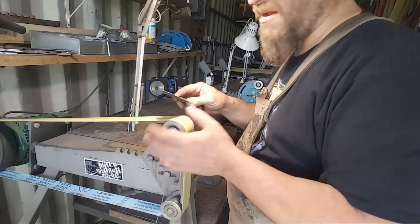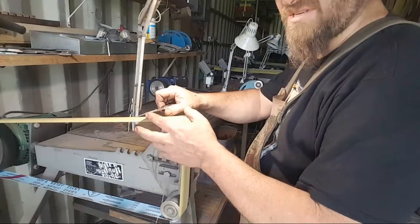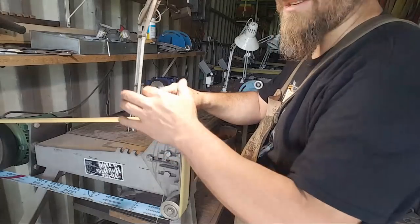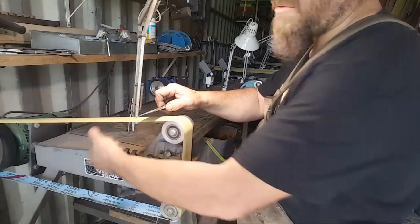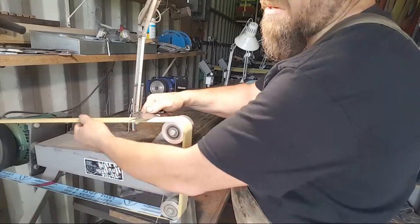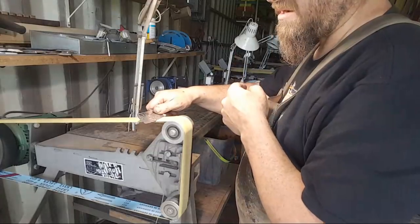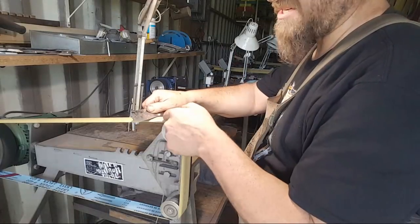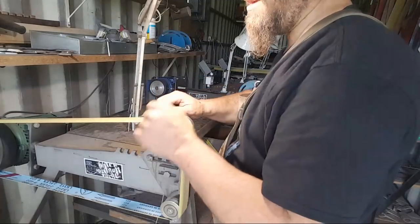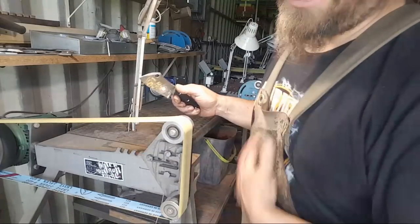Okay, so my belt turns the same way as it is when I'm actually grinding. I see a lot of guys that'll put their machines in reverse to then grind that way, and apparently people are saying that that is safer. I don't know how you can say that's safer, because you can't see the cutting edge, right? And there's no difference between that belt running that way and you grinding in that fashion, or the belt running this way and you grinding in this fashion. Yeah, you need to wear eye protection, which I'll put on just now, and you can actually see what you're doing. You can see whether the burr is forming. In that fashion there, you need to lean over the machine. You're closer to the machine, unless you've got a heavy-duty apron. You might be grinding the nether region, which is never fun, right?